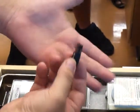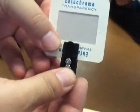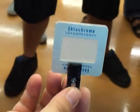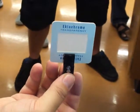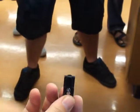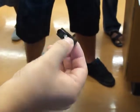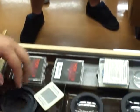This little thing here is a card holder or dual filter holder. You can put a little card here and see where the laser beam is hitting and do your adjustment with it. Or you can put the diffuser on so that you don't have to hold it in your hand. It's just a little convenience device to hold a filter or something else in position. It also has a little screw hole so you can mount it on a post and put it in a post holder.